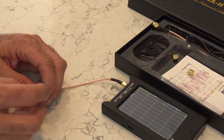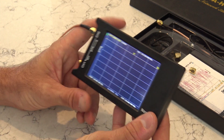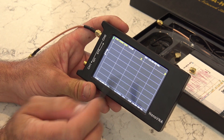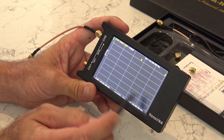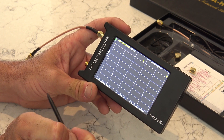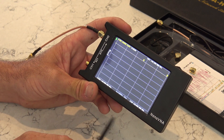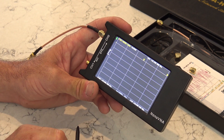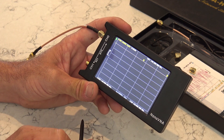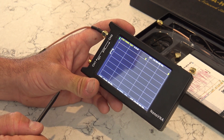Now I'm ready to test a two meter antenna - I'll bring this outside. You can set up different traces: you can have the Smith chart going, SWR in linear form, phase, return loss, or reactance - up to four traces simultaneously. I'll show you that. There are so many things in here you could probably do that I don't know about, but the average person is going to want to use this for testing SWR, maybe a Smith chart, and checking their antennas.